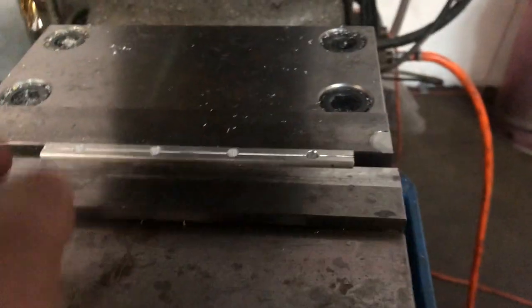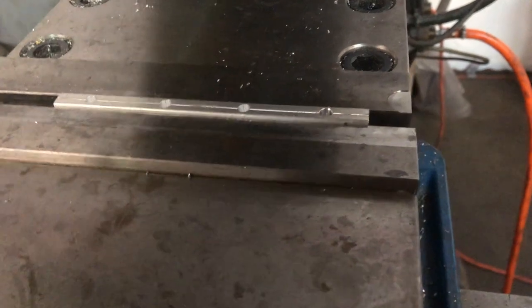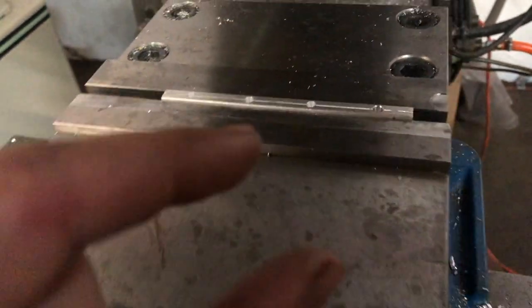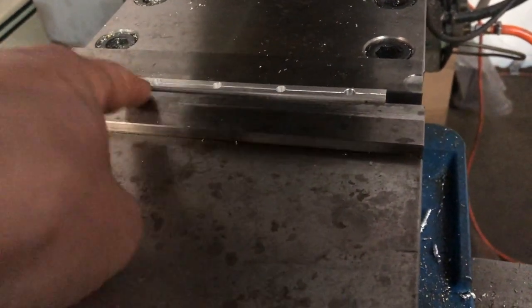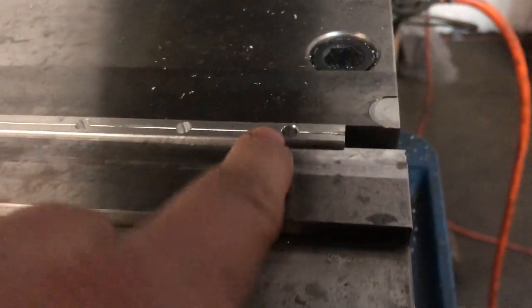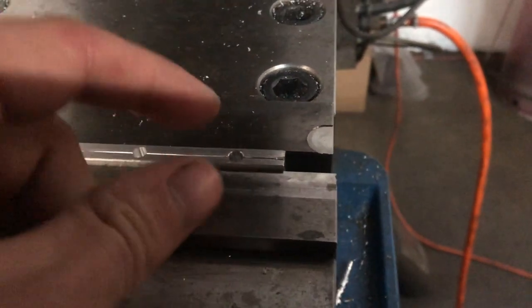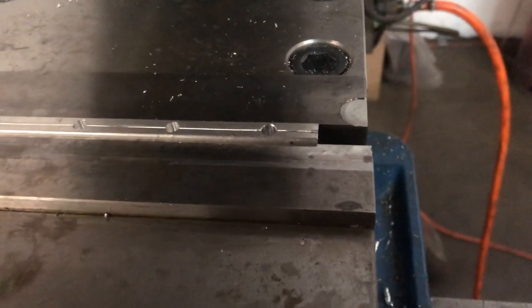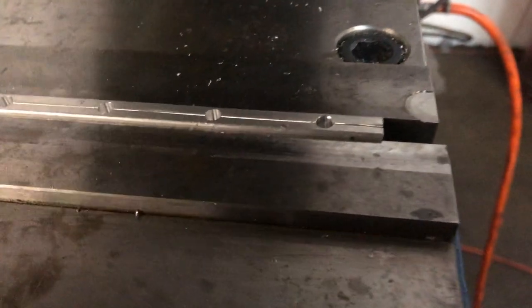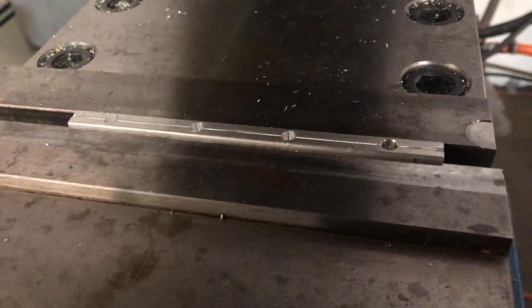So what I'm gonna do is take those brass hex pieces and bore through the center of those into a counter bore, and I'll make a piece that will go through the brass piece and then press into these holes. Press fit, that's what we'll go with, because as I tried to tap through this first hole, it started to spread the two pieces of aluminum slightly apart, and it just wouldn't work. And then I ripped the threads out of it because it's just aluminum with a tap, so that wasn't going to work. So we went to plan B.